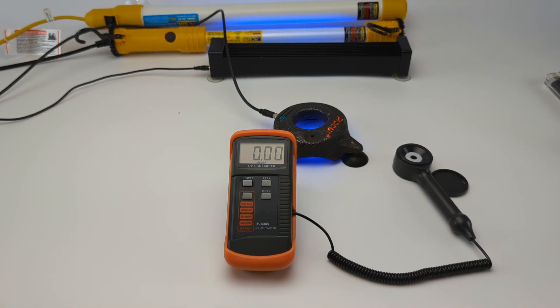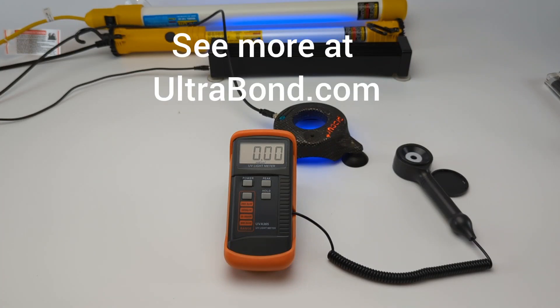This is a structural repair you're doing, and to maximize the resin's ability to bond and hold that glass at 100 percent of new glass strength, it's not worth those 90 seconds to compromise a customer's safety device. Thanks again — this is our video on UV curing lights. Buy yourself a UV light meter.